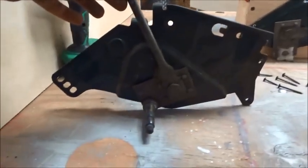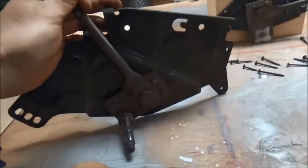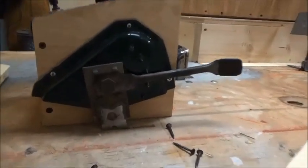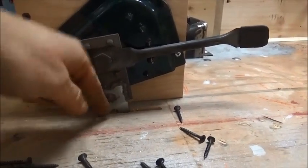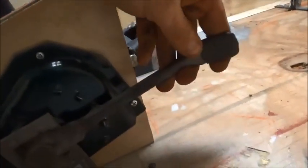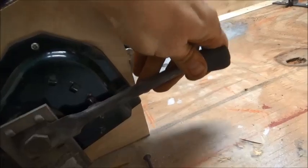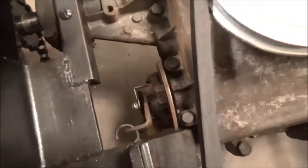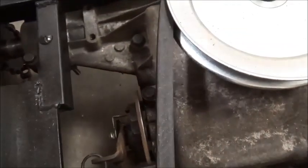This is what I come up with for the parking brake. What this is, is this piece right here off of a push mower. The wheel went on here, and this is how you adjust the height up and down of the wheel. So I trimmed it down a little bit, and I took off the part where the wheel was on there, and I have a piece of metal going through the floor. Now this, you just pull up on it and it holds it in place, and then you let down on it. It doesn't adjust much. I gotta adjust it a little bit underneath, but it goes through the floor to this lever right here, and then goes up. The rod goes all the way back to the back, to a spring that you can't really see. It's right there. That pulls on the brake lever for the original brake on the transaxle.